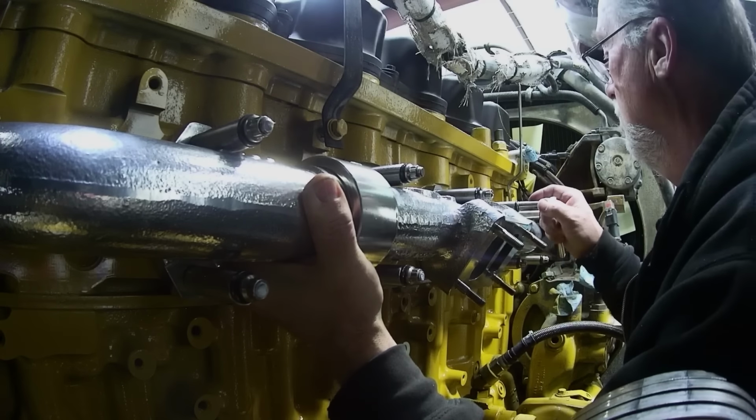That way you'll be assured to get the right stuff. Anyway, so I've got everything on. I've got to do the exhaust. I got a new piece of flex pipe because I need to come up a little closer. I got a coupler with an EGT probe in it there, and I've drilled and tapped one in the manifold here. And the reason I'm doing that is I'm going to put twin EGTs in here so it can see before the turbo and after the turbo.